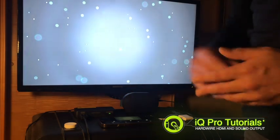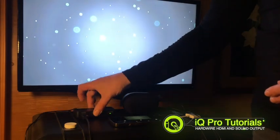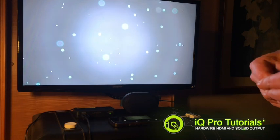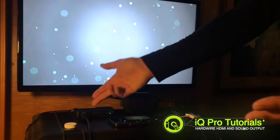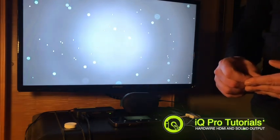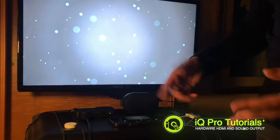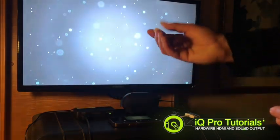That's a little demonstration of how to hardwire the iPhone using HDMI out to the audio extractor, which gives you mini jack out and HDMI out. All you have to do is explain to the technical staff that you're going to require a DI box backstage and you'll be giving them a mini jack out — they will provide the mini jack going into the audio extractor. Same with the HDMI. You can carry a short HDMI cable as well, though the venue will usually have one. Typically you only need to carry the HDMI audio extractor, the connecting cable, the HDMI to lightning, power, your flick button, and you are good to go.